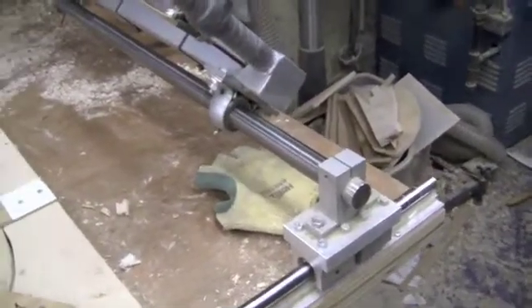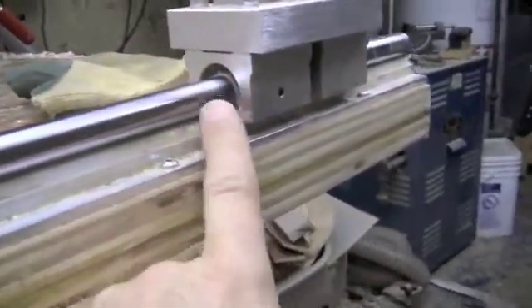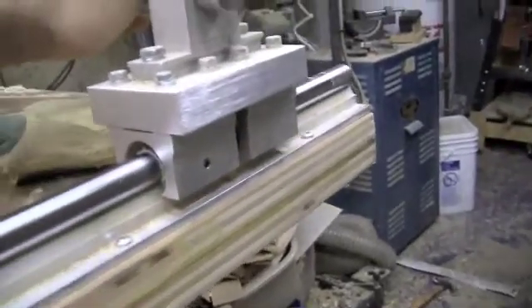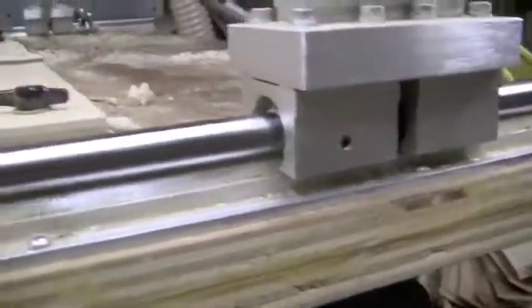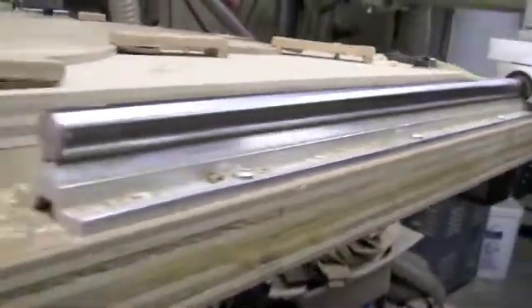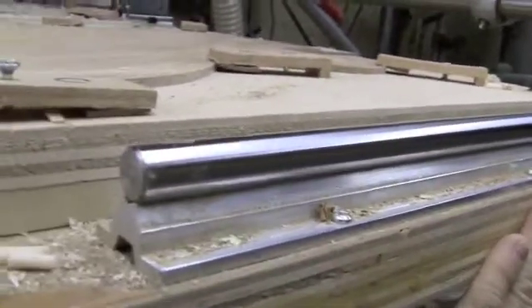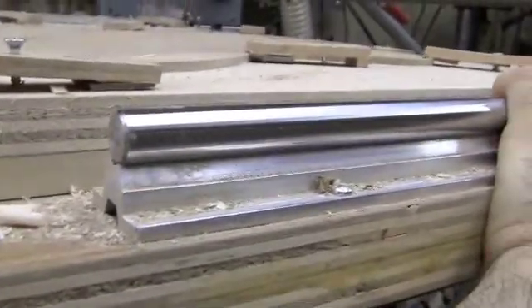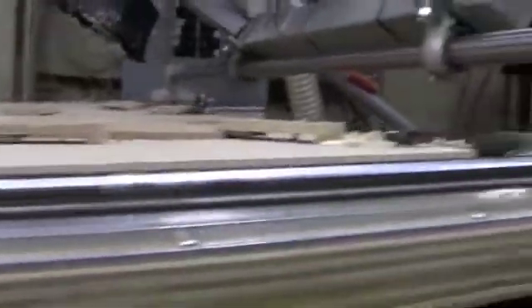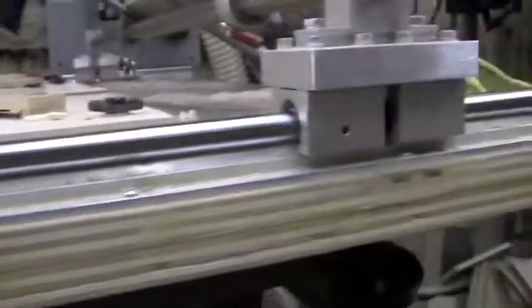On the base itself I have mounted these steel rails which mate with these bearings here. I got these from a place in China on the internet — it cost me about $120 to have that delivered to my shop in Toronto. I went with a mounting where the entire rail is mounted onto two thick pieces of plywood because I felt that would provide structural rigidity to the base, and I felt that if I had just mounted a suspended shaft it might bow in the middle as the weight of the carriage slid across it. This works very well.